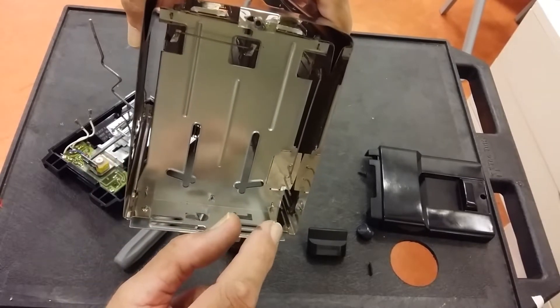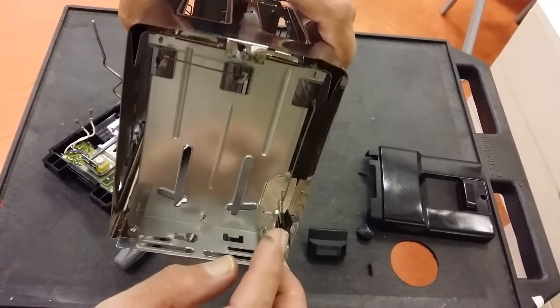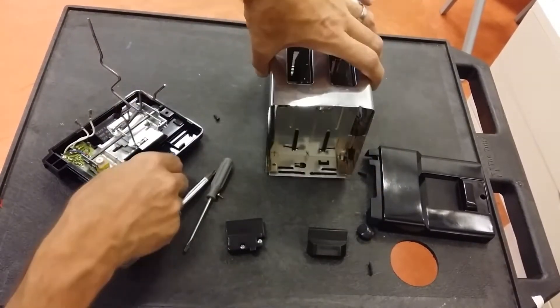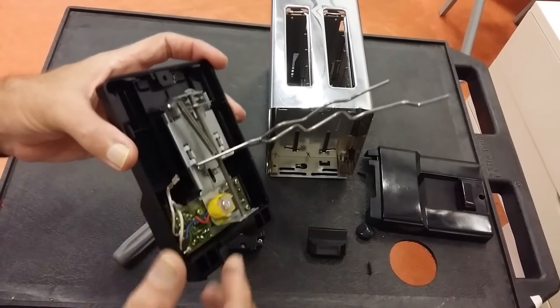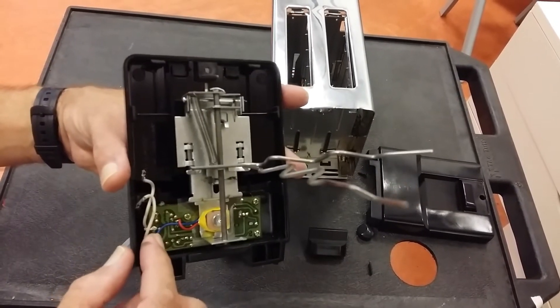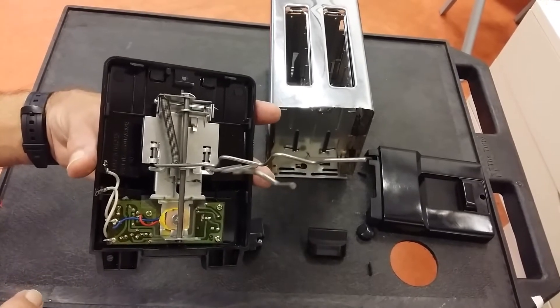It's just maybe the bottom 5% of the heater, and that gives you something like 10 volts coming out, which connects to the wires going to the electronic circuit. That means we've got something like a 5% share of the mains voltage to power the circuit safely.